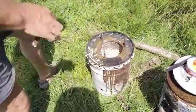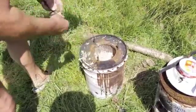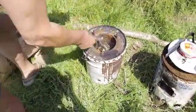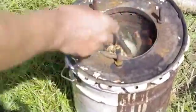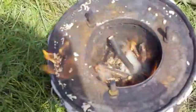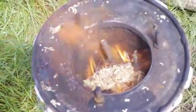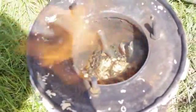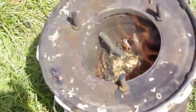As you do this, the bottleneck will be how many dried twigs you've got, so look out for them. You can see now, this is only about 30 seconds later, that there are good flames coming out of here. And if you look down in there you can see the smoke — wood smoke is nearly all hydrogen actually. And so you can see there's almost a gas ring forming around under the rim there. The smoke coming off there is actually gas, and it's burning like a gas ring. That's why it's called a wood gasification stove — it turns all the gas in wood, the potential in wood, into hydrogen mainly. So that's mainly hydrogen burning.